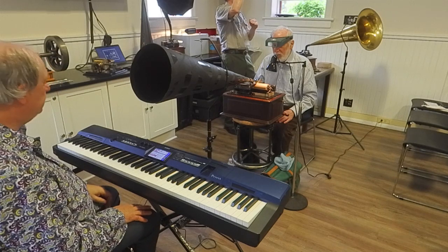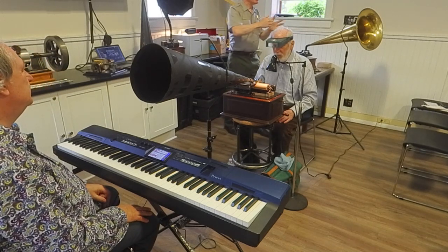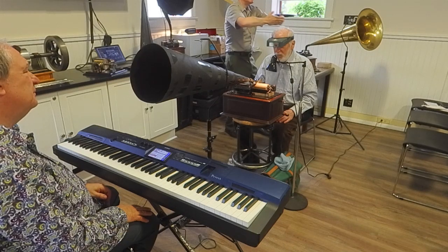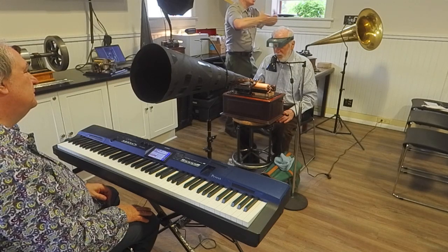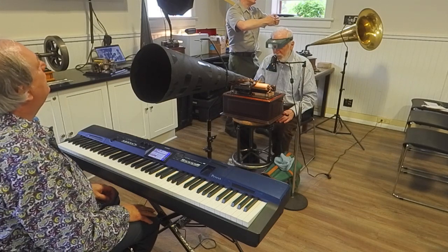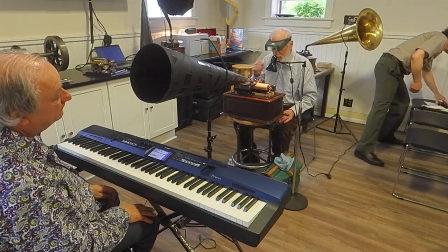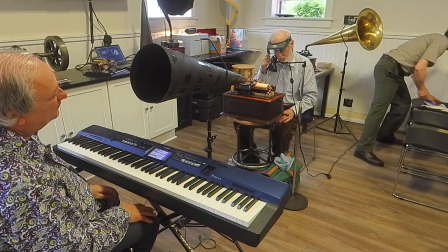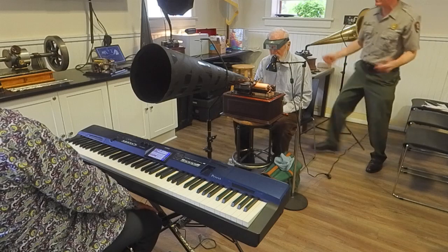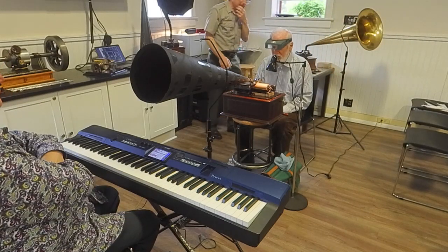If it's too loud of a sound, and you're just banging the diaphragm with pressure, there's only so far it can stretch when it's shaking back and forth, so at a certain point it'll just stop, and an audio engineer would call that clipping. And again, very literal, what's happening? The knife is just clipping off the top of the wave. All right, so let's give it a shot.